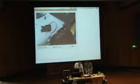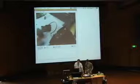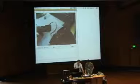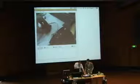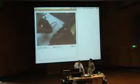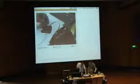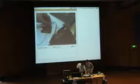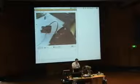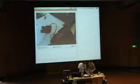Unfortunately, you probably can't see it too clearly, but what I have here are the 4 wires coming out of the end of the Nunchuck controller. Basically, it's a couple of power lines and a couple of communications lines. So what I've done is connected it up to ground and plus 5 volts, and at the other end, I've connected it to a couple of the I/O lines. I also have piggybacked off here another little connector, a header, which will connect up to a servo. So this is going to be a bit of a double demo, so twice the things to go wrong. We're going to use one of the digital lines, one of the PWM lines, to control the servo based on the accelerometer input that we're going to read off the Nunchuck itself.